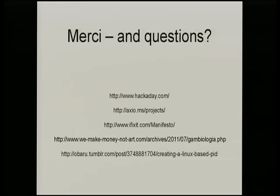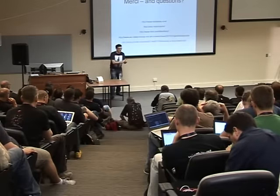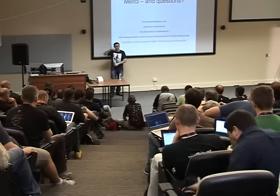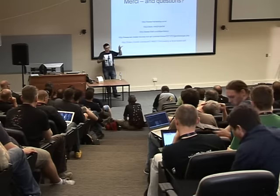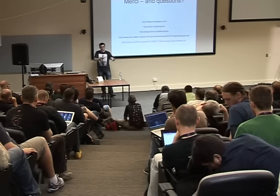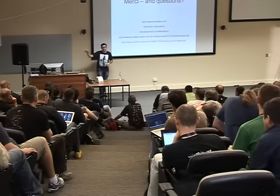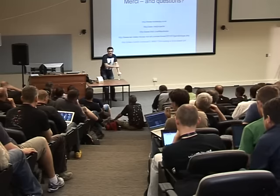So a project I've half started on about 3 times when I've been doing this, getting really annoyed and going, right, I'm going to write a proper disassembler that will also be able to reassemble and that sort of thing. One of the things I'd like to see would also be to start scanning here and go through and actually interpret the code that you're disassembling, because then a lot of the constants, so for example on MIPS, you'll load 32 bits, you'll load an upper 16 and a lower 16. And a lot of the disassemblers will just treat those as separate values. What I'd like to see is the code actually executed, and for it to go, oh, that's B00115, that's the UART receive register, and actually put those things together. So, please continue on that project.